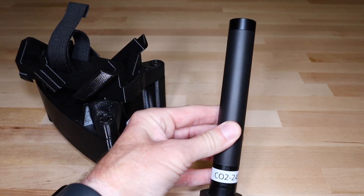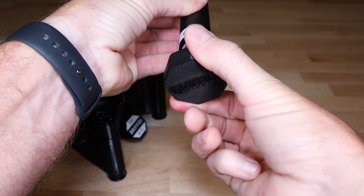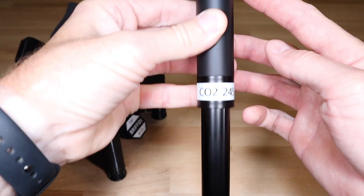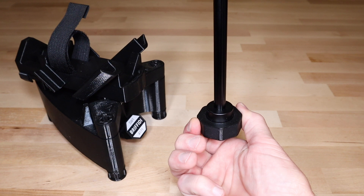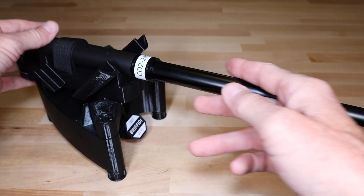If using the extendable rod, unlock it by twisting the end counterclockwise. If you do it slowly, you'll feel four sections unlock. Extend the rod and verify that four internal sections plus the handle are extended. Hang the rod vertically as you lock it by twisting in the opposite direction. I suggest starting with measurements in the extended state as it's easier to collapse it while still mounted in the SW1.